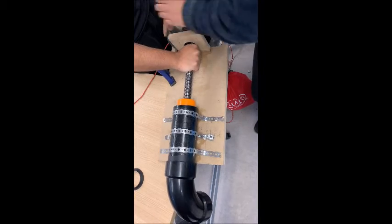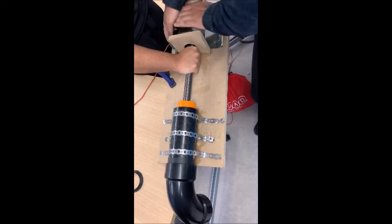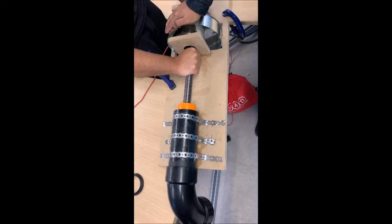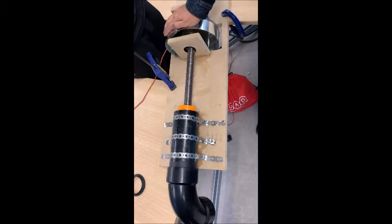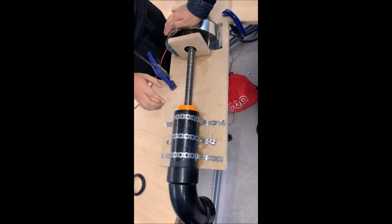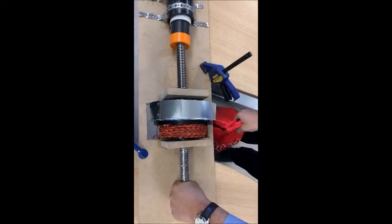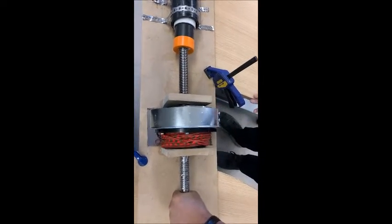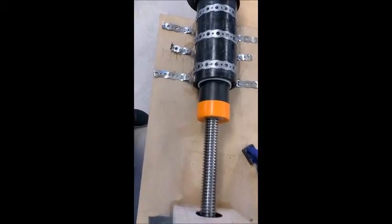As the weight is dropped, the spring will be pulled and compressed in the same rotational direction as the cap. The spring is welded to a nut which turns the Acme threaded rod when the cap is held stationary. Afterwards, the spring will have enough energy to rotate along with the nut and push the threaded rod. As the rod turns, it will move towards the plunger that's enclosed within a pipe which is attached to an elbow where water will be coming out.